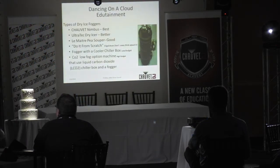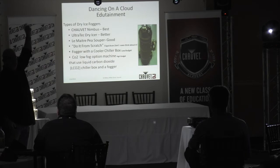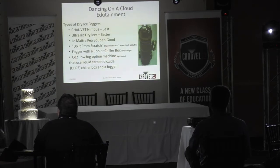If the alarms go off, usually the fire sprinklers are not gonna go off unless the fire is directly over the sprinkler head and the little fuse link blows. Okay, and then what's gonna happen? All the sprinklers are gonna go off, right? No, just that sprinkler right there. So you have your handy dandy little wedge kit, right? Grab the wedge and you put the thing in there and you turn off the water and you save the day. Unless there's an actual fire, then you run like hell. And we all yell fire, fire, fire. No, we don't want to do that.